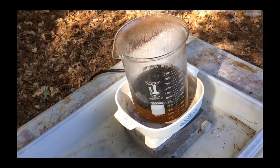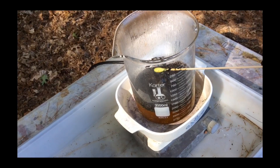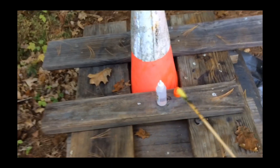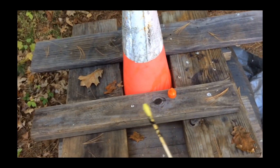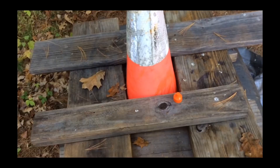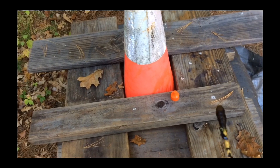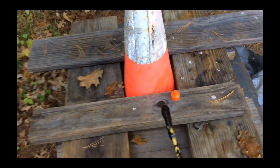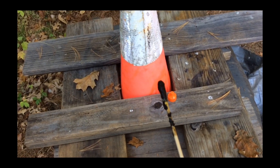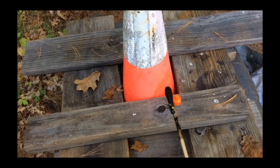So now comes the fun part. We are going to test for dissolved gold. Got a lot of bits of solder mask on there. So we dip that into our solution. We are going to test it with stannous chloride. Here it goes. Black. Super black. We have dissolved gold. It doesn't test the presence of gold — it tests the presence of dissolved gold. The beaker is full of dissolved gold.